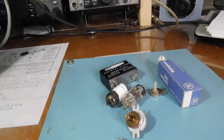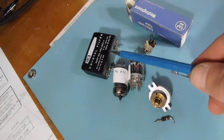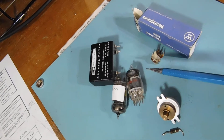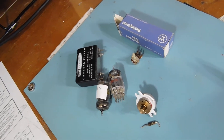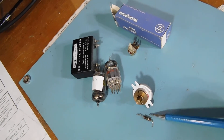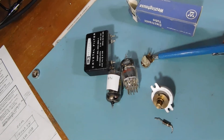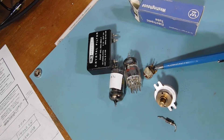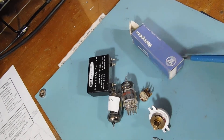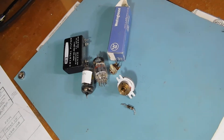Here are the parts I ended up replacing: CW filter, two tubes — heterodyne oscillator and VOX amplifier — that were not the right tube, a resistor, the Jackson Drive was bad, the carrier oscillator 200-ohm carrier null control, and it was actually missing a 6088 tube. That's the parts count.